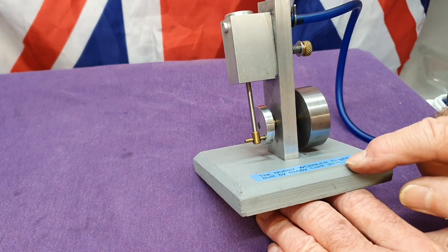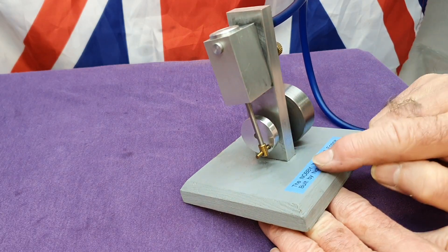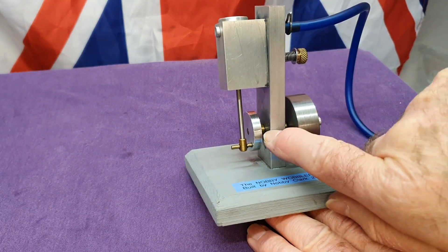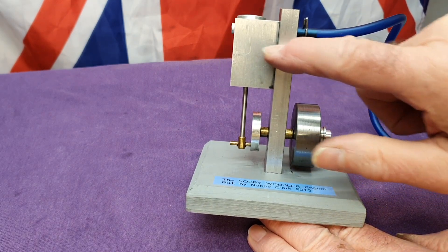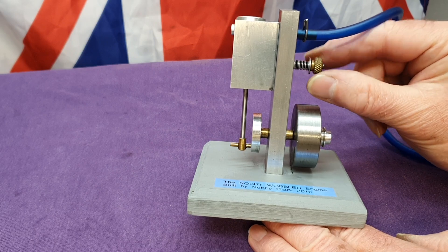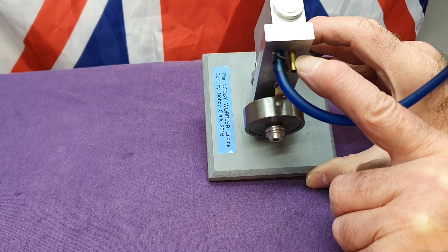The cylinder is made out of a piece of aluminium, and the little cap on the top is also aluminium. It has a steel rod here joining the piston down to the little cam on the bottom, a little brass end with a brass pin through here, a steel axle that runs through the center with two little brass spacers in between. There's a steel screw that comes through here, and I've made a little knurled brass nut on the end so I can tighten that against the spring to give the cylinder tension.